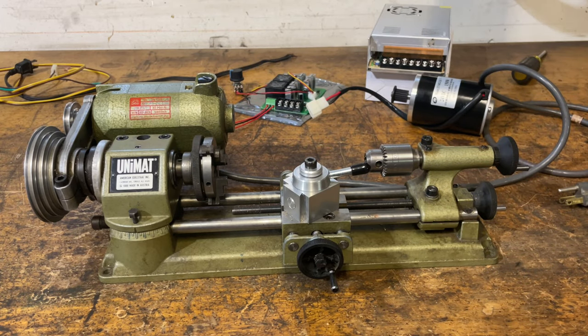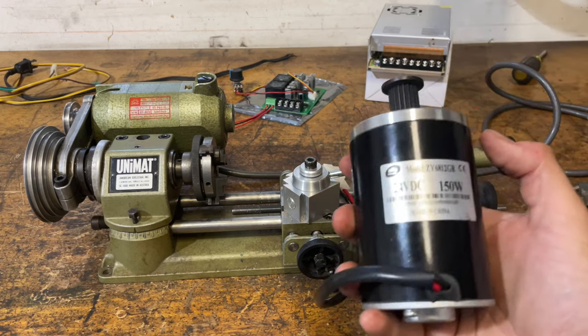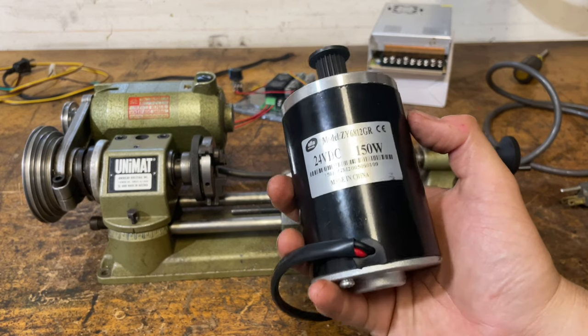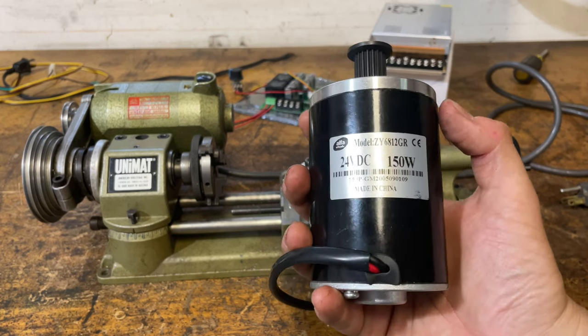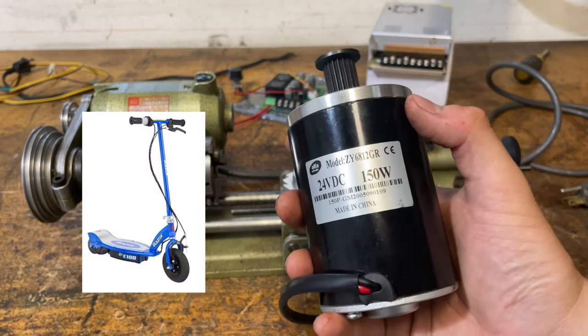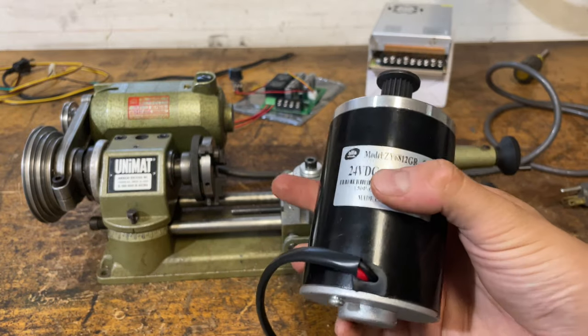There are models that come with the gray plastic motor, the U100 motor — it's got an orange little slide switch. That's the only continuous duty official Unimat motor they made because it actually has a built-in fan to keep it cool, but after running one of these things for a while you'll realize that this motor gets extremely hot.